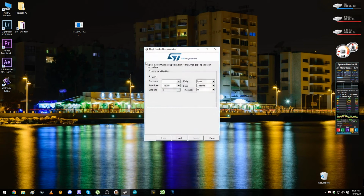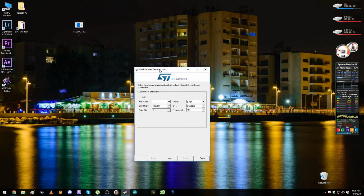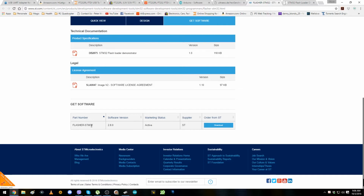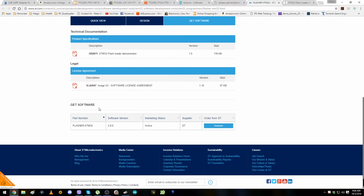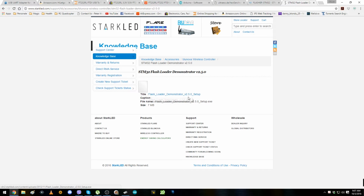So now let's open the flasher STM32. I was having problems with this STM32. The reason, I don't know exactly why, but I just uninstalled it and downloaded a new one from this website right here. I'm gonna put a link in the description where you can find it. The good way is to just start by downloading this one. If it doesn't work from the main website, from the flasher STM32, just go to the next website and download the old version of this Flash Loader Demonstrator.